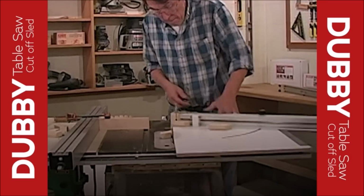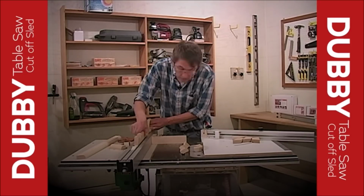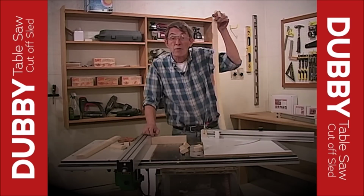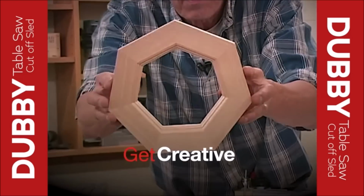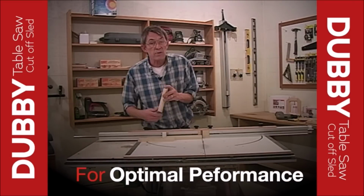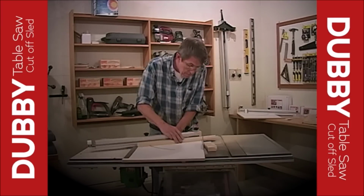It is ideal for making frames, but it also works very well for the cutting of tiny pieces while keeping your fingers out of harm's way. The Dubby has the capacity to cross-cut panels up to 24-inch wide, 52-inch long, and allows you to do them safely. Since the panels don't make contact with the table saw top, walking of the material is virtually eliminated. This will allow you to cut perfectly square panels for your furniture and cabinet making projects quickly, easily, and accurately.